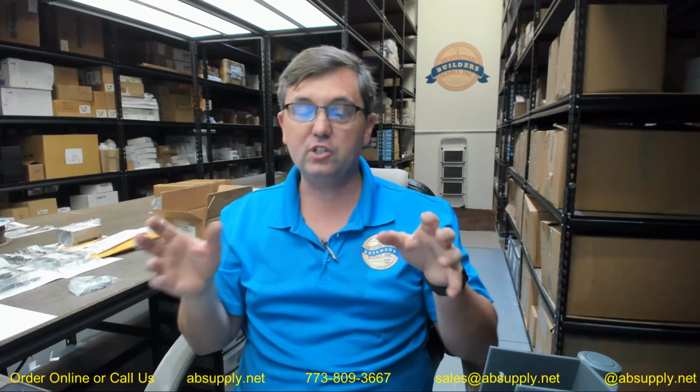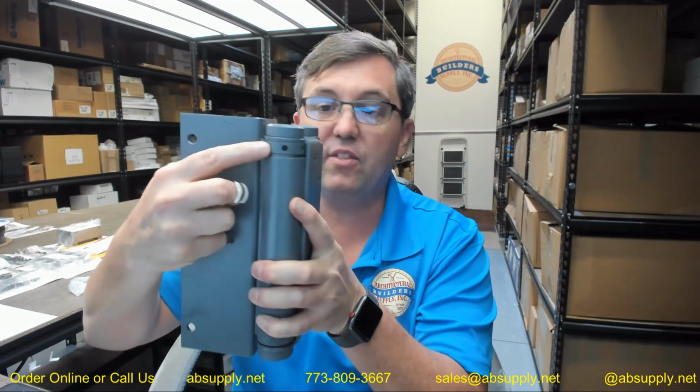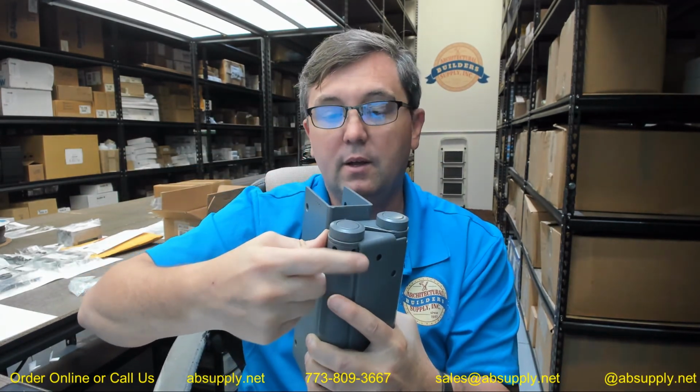If the door is too slow or sags, increase the tension. If you're at 5 holes of tension and you still have that problem, check your door weight, check the width, make sure the quantity of hinges is adequate. You might need to add a hinge up at the top to help mitigate that. Those would be reasons why you might. But again, you do the tension setting on this collar and this collar. That's why you need 2 pins. And then when the spring pushes the collar back, the tension pin is going to just rest against the shoulder of the back jam leaf.